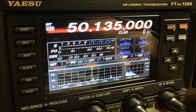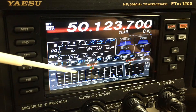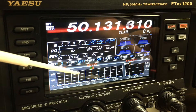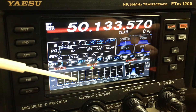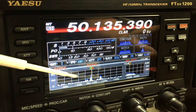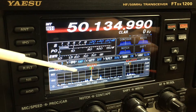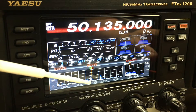I want to show you what it looks like when the scope becomes active. I'm going to turn the VFO knob and you're going to see this become active. When it becomes active, the audio on the radio is cut, so I don't hear any audio at this time but I do see the peaks. When people talk, you'll see a peak appear in the display. If I park on one and turn the volume up — he's on 5135. You can see how I found that station by looking at the scope.